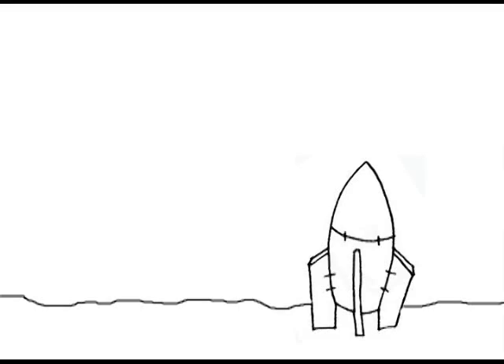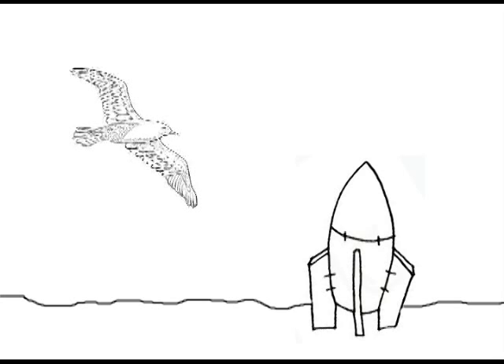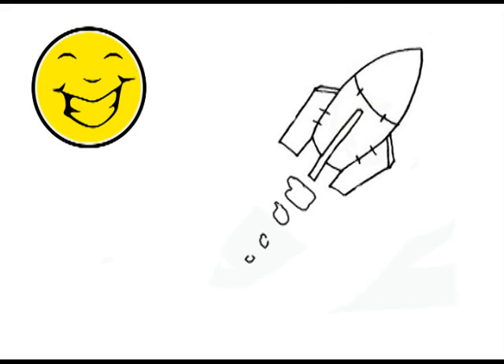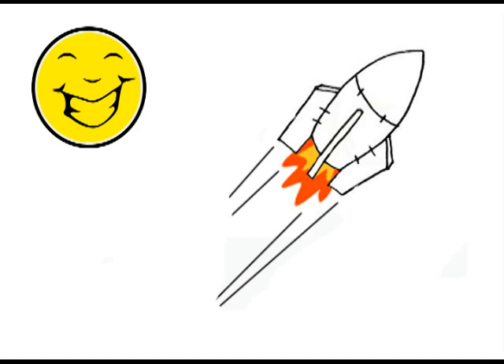Here's a quick recap of what we're going to test today. The engine starts out as a solid, burning six pounds of potassium nitrate and sugar in one second with a KN of 550 — this will get the rocket up to speed. Then after it coasts for a few seconds, it'll switch to a hybrid, burning 10 pounds of NOX and 2 pounds of PVC, sustaining speed to gain altitude. All this using the same engine casing and same nozzle.